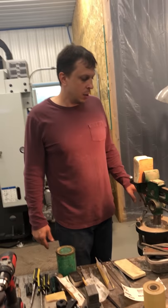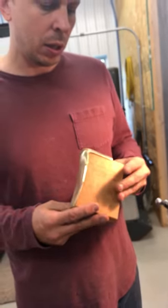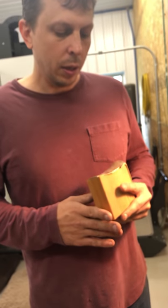Okay, I'm back with you. I've sanded the butt plate down to 150 grit, the whole thing. Then I went to 220 grit the whole thing, and then I went up to 320 grit covering the whole thing. And I suppose the process took maybe 20 minutes, 15 minutes, I'm not sure. But it doesn't take too long. The progressive grits go a little bit faster with each grit.